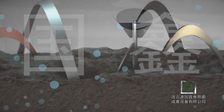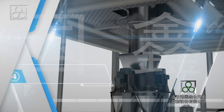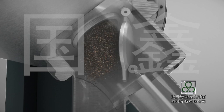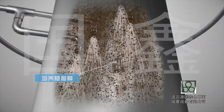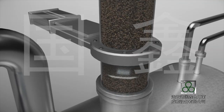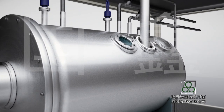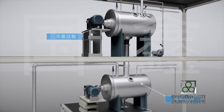When the substrate temperature drops to the set temperature, sterile air goes into the chamber of the cooling machine. Step 4: Inoculation. The discharge valve opens and the cooled substrate goes into the hopper of the shiitake substrate filling machine. The substrate is inoculated during conveying to the bag filling machine, mixing the spawn and substrate. Meanwhile, when the substrate enters the cooling machine, the valve at the bottom of the sterilization machine is closed so that new substrate can enter the sterilization machine again, allowing cooling and sterilization to be processed simultaneously.